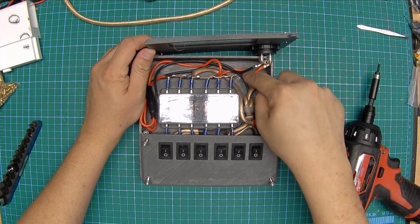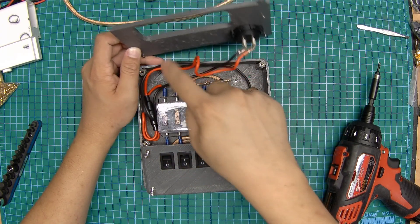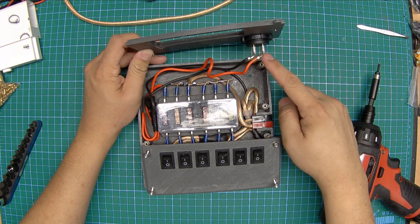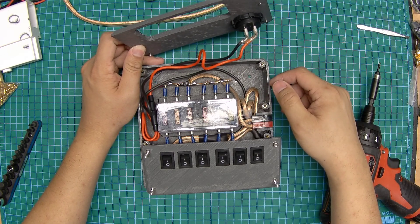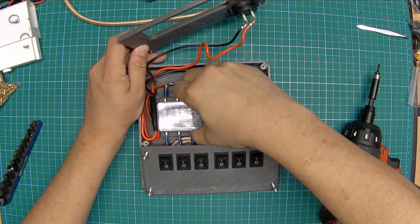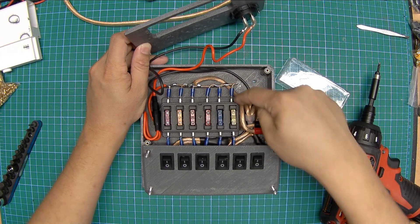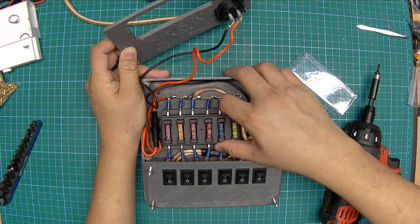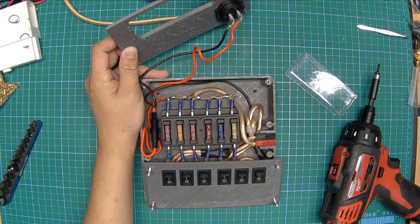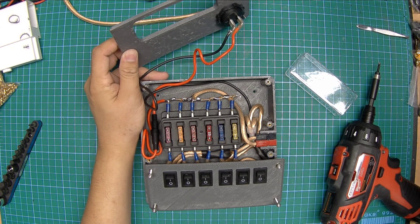Here it gets a little more janky. I wish I could have done a better job in the compact confines of this unit. What I do have though is the voltmeter, which is independently fused for better or for worse. It does take up a bit more space and it's not really well laid out — you have to open it to service it. But in theory this voltmeter should never need replacing because why would a voltmeter decide to blow a fuse? And if you have to replace the fuse then probably the voltmeter is toast anyway. So I've got this quasi-bus bar arrangement with this automotive fuse holder, so you can just pull fuses out. This unit is actually fastened down using VHB tape on the bottom side, so there are no fasteners or things to come loose. And I just noticed there is a loose wire inside here — a piece of solder or something — a metallic thing inside there. That's not a good thing to leave behind.